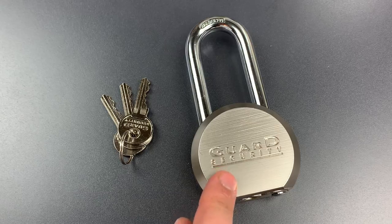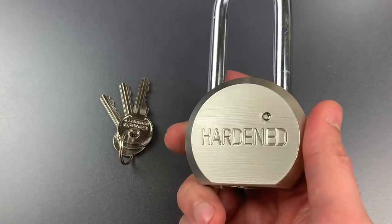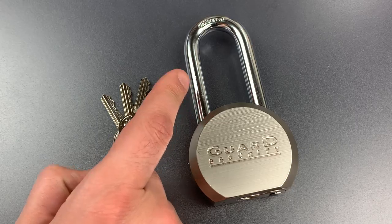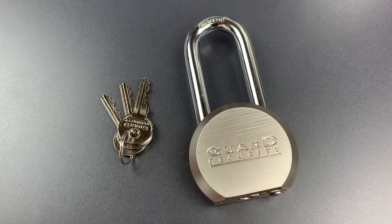This was made in the PRC, not the ROC, and the quality was not anywhere near what I was hoping for. We have a pretty standard looking round body padlock. It says hardened on the back, but I checked and that is not the case. We do have an 11mm shackle that is hardened, held in place with a ball bearing locking mechanism. From what I can see on the outside, the core is 5 pins and of fairly low quality. But let's try to pick it open and see what it takes to get inside.